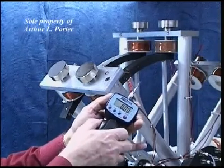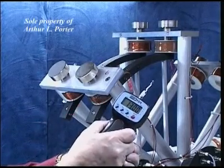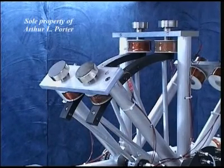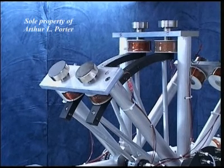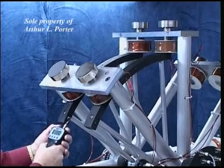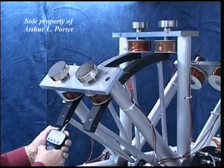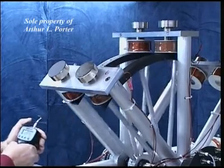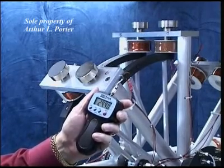Now I have this little scale here that as you pull tension on it, it'll lock and hold the highest reading. So I want to do the same test on this motor that I did on the little demonstration table. First, at 18 volts, I'm going to check the maximum force of the permanent magnet only. 29.9.